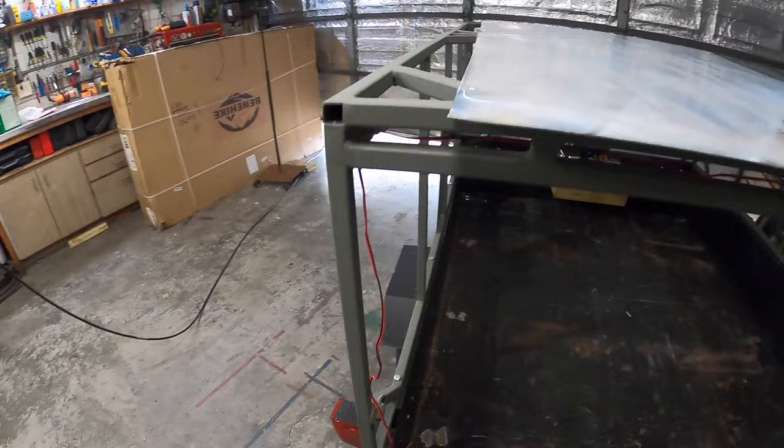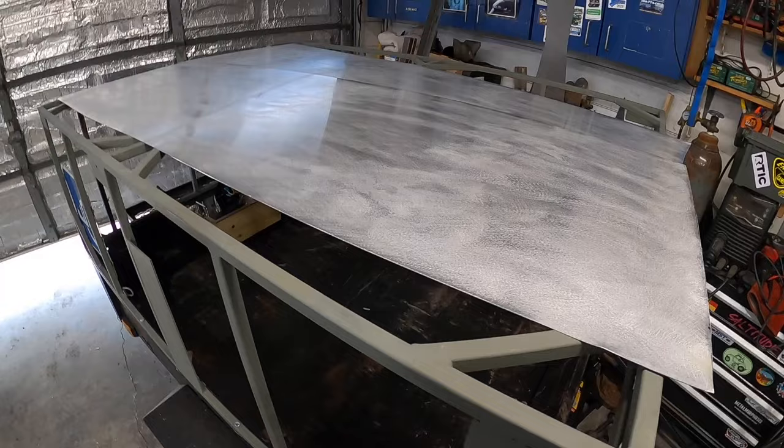A lot of the times when people build these teardrop type trailers and whatnot, all they use is construction adhesive and stick it in place. I have watched some videos and done some research where they use this style tape and that's it. So if we do both, we're definitely good. And that was the reason for sanding, so we have a nice, strong mechanical bond. So that's it. Let's get this thing attached and I'll show you the next phase.